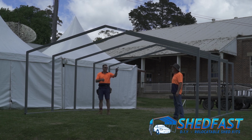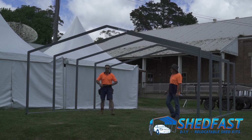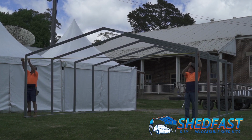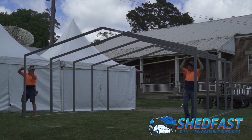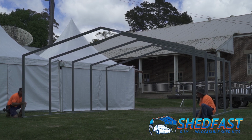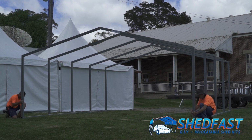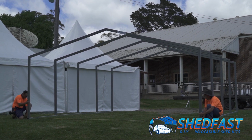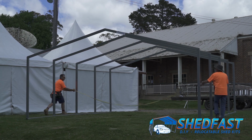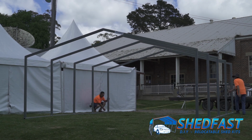And the first part of that is to measure at the top, between the screws, and then you take that measurement to the bottom and take it along the base. Okay, so I've got 58.50 on this side, so go to the bottom now, and we're looking for 58.50 there. So we just adjust it out or in, pull yours out a little bit, Rob. Yeah, 10 mil more. Okay, so we've got 58.50 there. We'll go to the centre. Same here, 58.50.